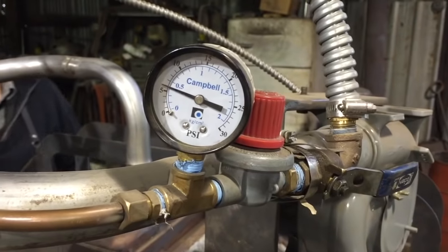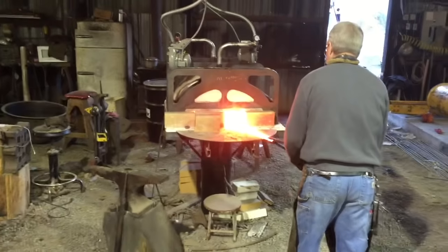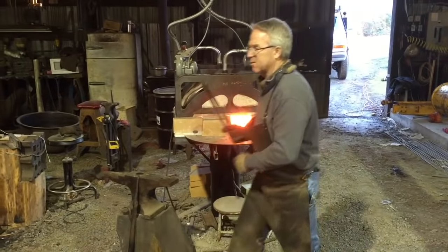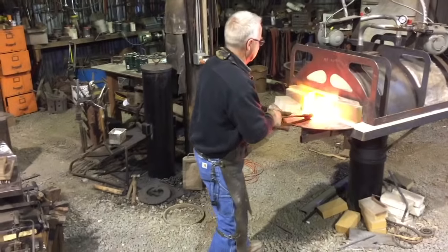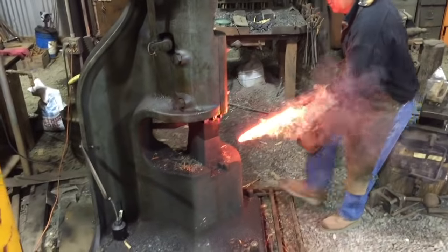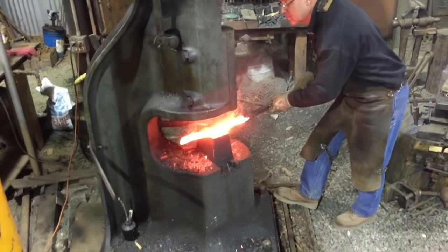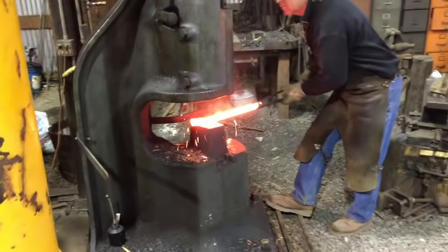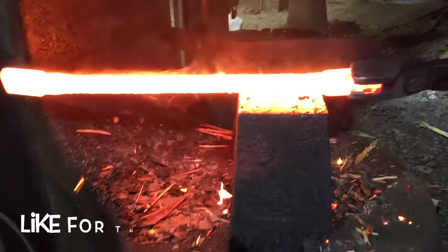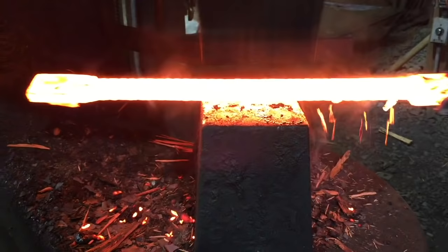This forge likes to start at about 7 psi — I don't know why it takes that much fuel, but it does to maintain the flame until the thing comes up to temperature, meaning the whole chamber is glowing with intense heat to the point that all of the fuel is instantly combusted when it enters. Once it comes up to temperature, I can drop it down to one and a half to two psi, maintaining a nice forging temperature of maybe 1,350 or 1,400 degrees. To get back up to a welding heat, I crank it up to six, seven, eight, nine pounds and it just really smokes.